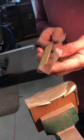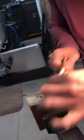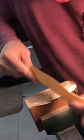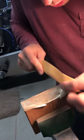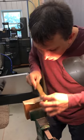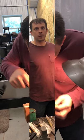Okay, so you continue this process. This is 150 grit, so we'll continue with this process until I turn the file, so it'll get a little bit more bearing up in here, where the radius gets a little tighter. Continue this process until you get the whole butt plate worked down to this grit, which I'm gonna go ahead and stop right now, and I'll bring you back when it's all worked down to this grit, because I don't want this video to be too awful long.